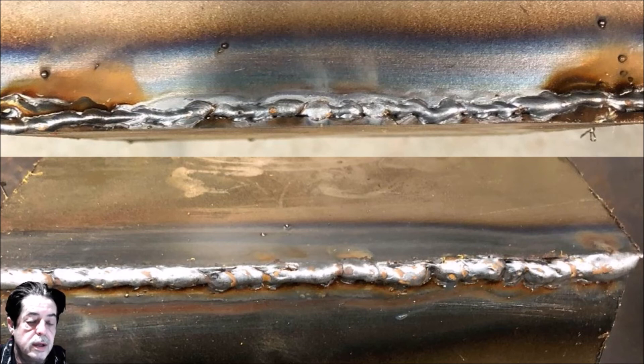Make sure you have the correct MIG wire. 0.023 or 0.025 is going to be fine for almost everything you do around your shop. There's nothing wrong with 0.030 but that's mainly for quarter-inch steel and thicker. Get comfortable before you begin welding — that's the big thing. Then slow your rate down. If you go too fast it'll turn out like one of those pictures, and flipping it over you may not have good penetration — if it needs to be structurally sound, you're failing.